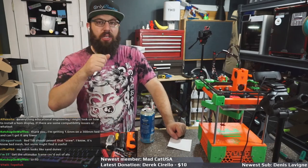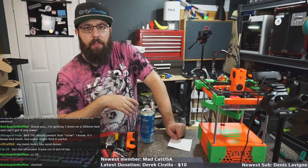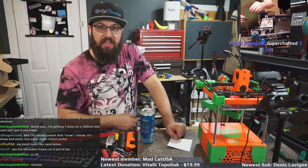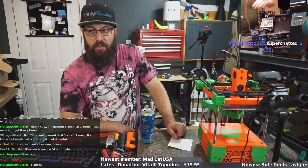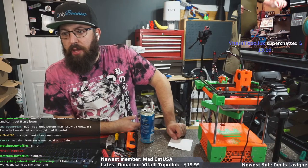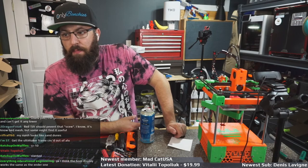Vitaly, $19.99, cheers. Slanted, CR10. Okay, you gotta re-level your bed then. Or you gotta tram your bed out. So bust out that piece of paper and start tramming. How are you determining it's out? The Z axis is not level. Okay.